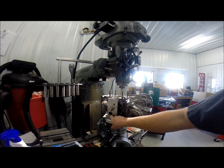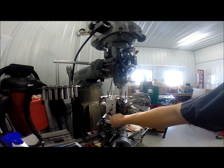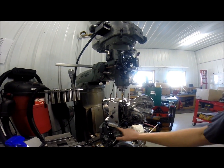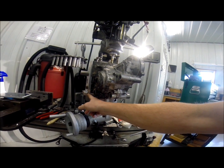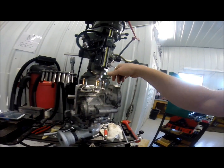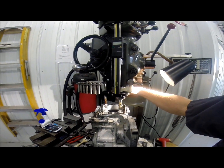So then we were able to cut these plates out. We've got these extra holes here — we can flip this case over if we want to, if we've got to do some repairs on the case. We milled this bottom plate, and this is all aluminum. We milled it out to a perfect width between the outside to outside on these case halves.